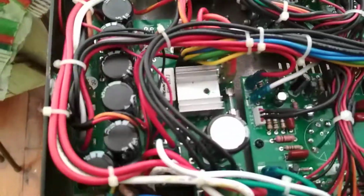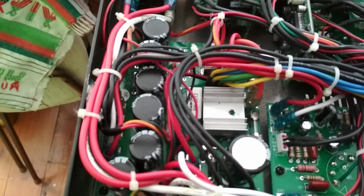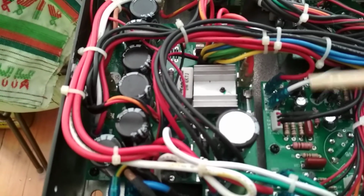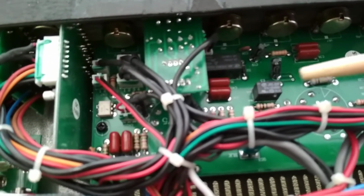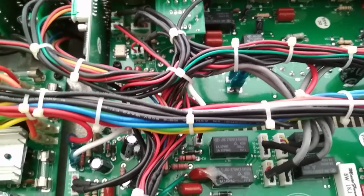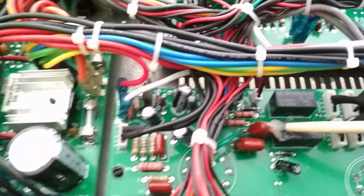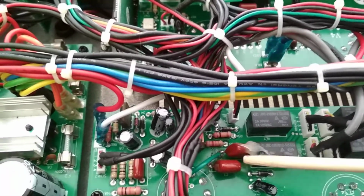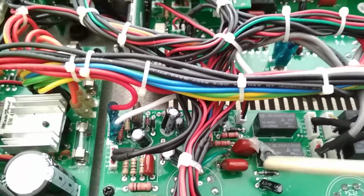But I was doing a visual inspection, and it keeps blowing fuses. That was the complaint from the customer. So I started off by looking at the power supply, and everything here looks nice and tidy. And then I sort of glanced over, because, you know, visual inspections first. When I took the chassis out of the cabinet, I could smell a little bit of the brown smoke escaping. Now, get down here to, let me see if I can point to this capacitor, and I've noticed it's wiggling around a bit. Anyway, I've cut this glue off because I'm going to replace the capacitor.